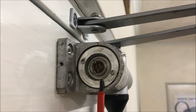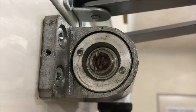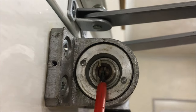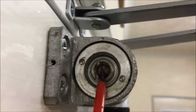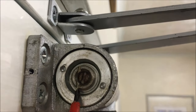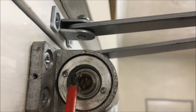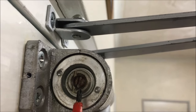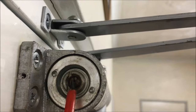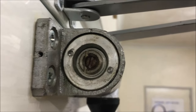The latch action helps overcome the resistance and friction of the latch sliding over the receiver. If you need to adjust the closing speed — maybe it's closing too fast or not fast enough — use that center screw. Turning it clockwise, to the right, will make the closer slow down, and turning it anti-clockwise will make it speed up. The adjustments are very fine, so a quarter of a turn may be all you need to solve the issue.